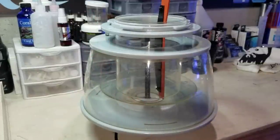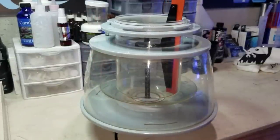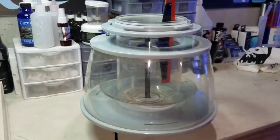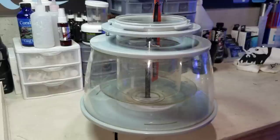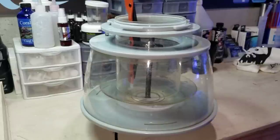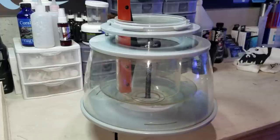All right, well, here is the first look at the Skimmer Swabbie in action. As you can see, it's really tight against the cup neck, causing the cup to actually move a little bit. So I went in there, loosened up the screw, and moved the blade back just a hair to allow it to touch the side of the inner neck of that cup, but not enough that it's actually moving it around.